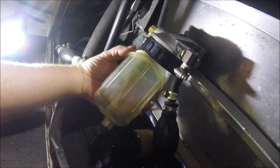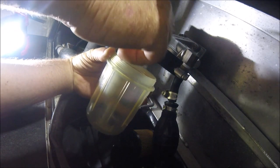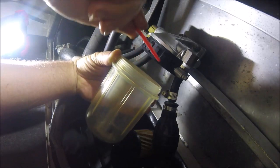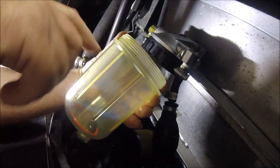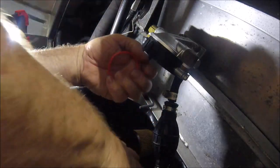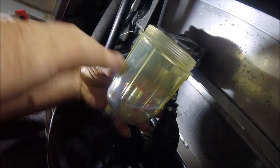You never know if you're getting any buildup of water in your fuel. Now this MarPak has a floating ring, and that floating ring goes down to the bottom of the bowl. If you ever see this ring suspended off the bottom, that's telling you you've got moisture in your bowl.